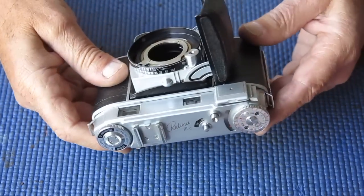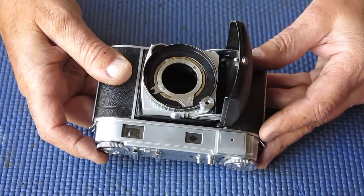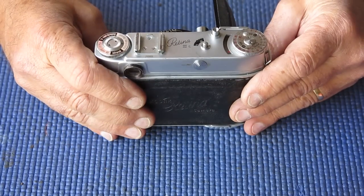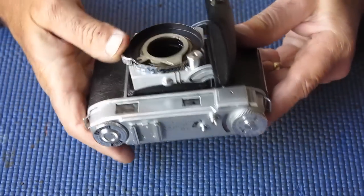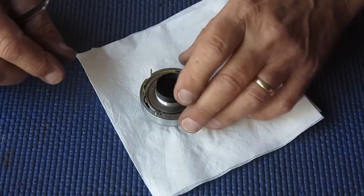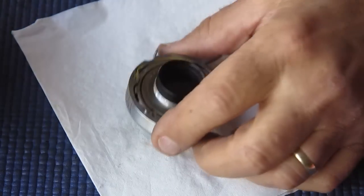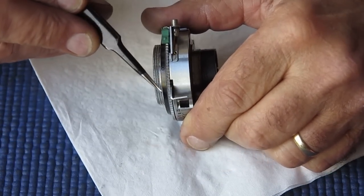One of the screws had been transferred to the top. The cocking rack was absolutely rubbish — it was chewed up in two places. Someone went out of their way to bugger that up. I'm going to work on the shutter next. I've already noticed that the shutter's got a little problem. The shutter release lever here is obviously bent — no idea what happened to that. I did notice that the arm in the camera, the finger that presses on that, was slightly bent too.